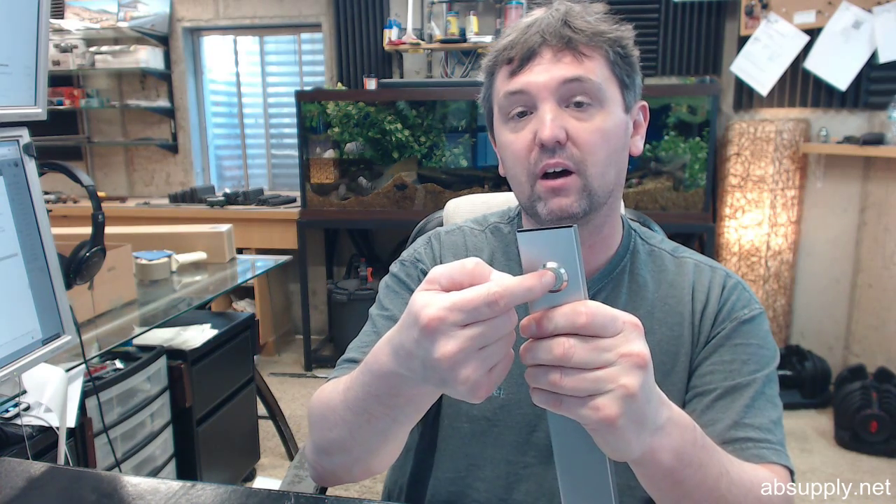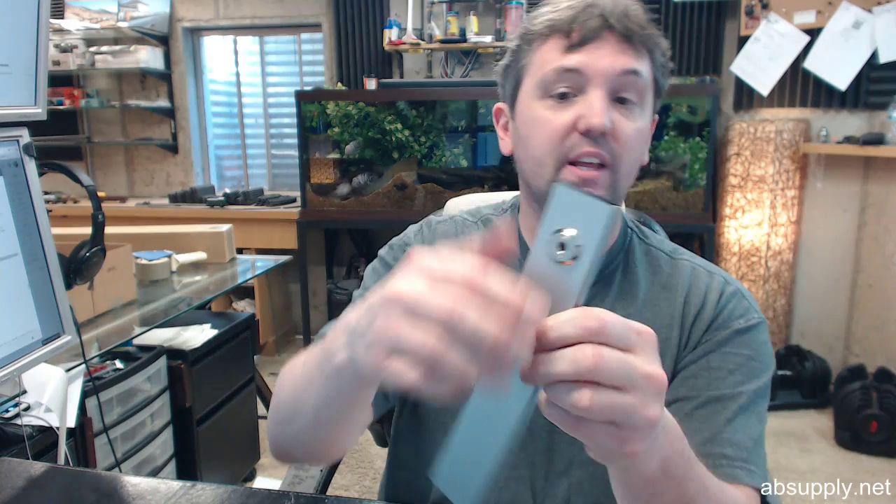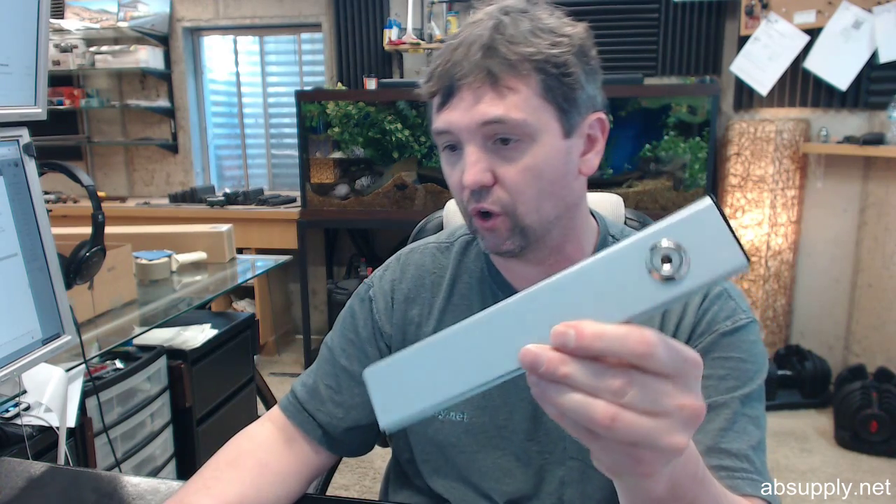Other available items for the 4700 rim device — this would certainly work for the vertical rod device as well. You'd have hex dogging on either a rim or a surface vertical rod, both non-fire rated. If your device does not have a dogging assembly at all but you need the cover plate, it would simply be a 4934F — the same plate, just omitting all provision for dogging.